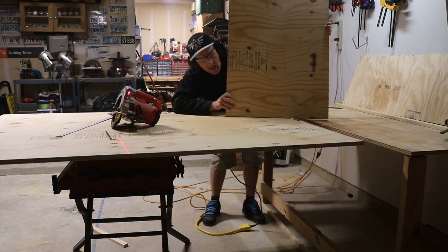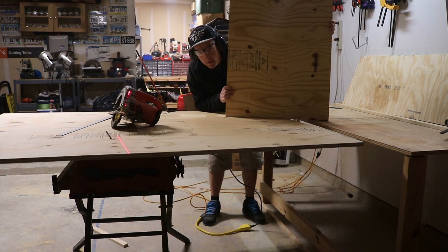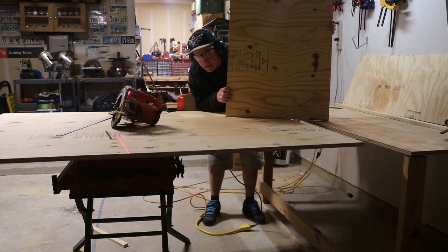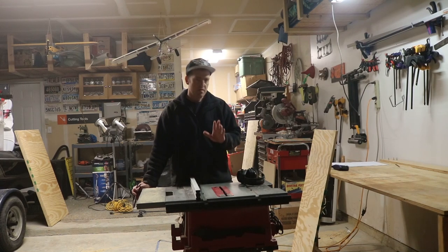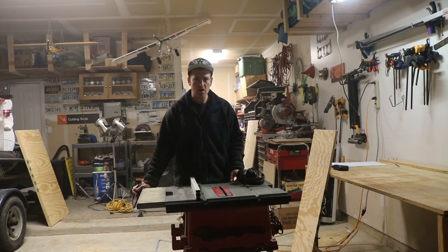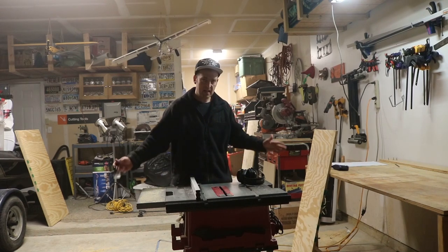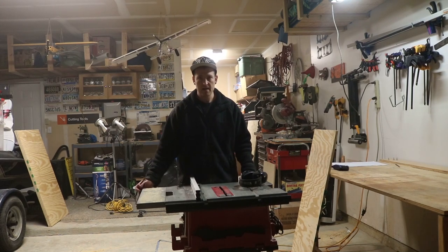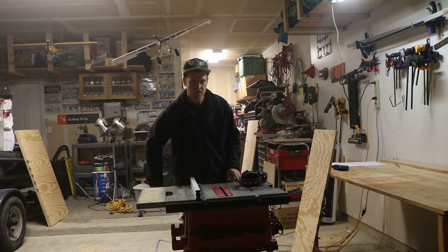Here's my 25 and a half inch wide piece, and I'll be able to cut this up into strips for shelving on the kiosk. The next is going to be the front kickboard, 6 inches tall, the floor and the backboard. And like I said they're all going to be 25 and a half inches wide, making the whole thing 27 inches long.